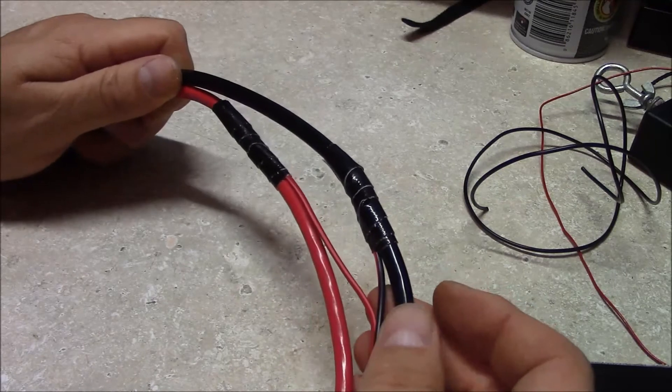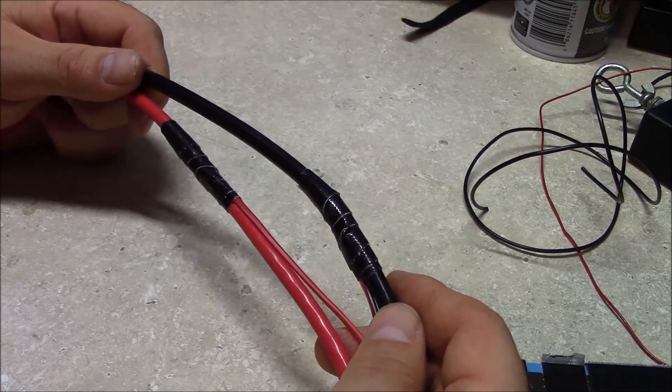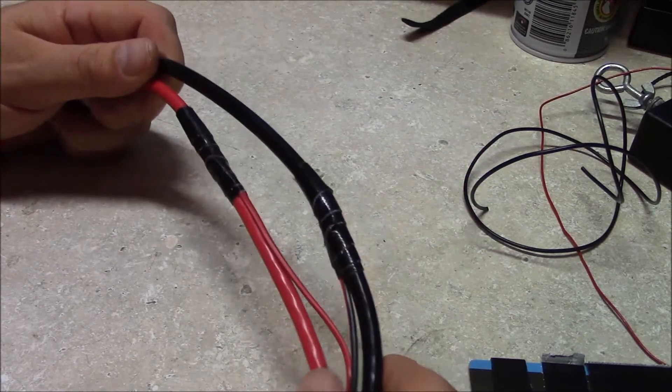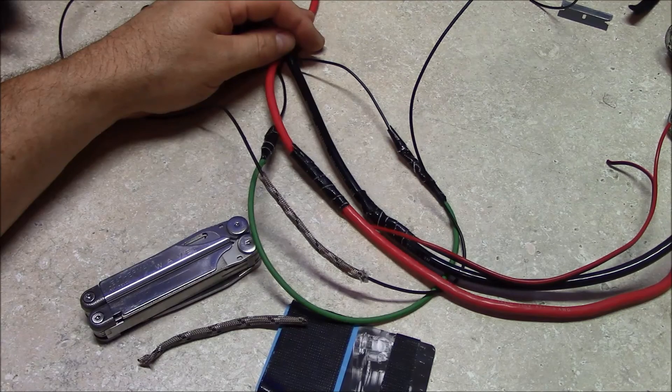When we did the ground, we just did the same thing. You want to make sure your splices are in different locations and make sure both are insulated. And if we had to tie in this small circuit into these existing DC wires, we would be good to go. I hope you never end up in a situation where you have to use a splice like this to complete a critical circuit, but if you do, you've got it in your toolbox. I hope this helps. This is Brett from Survival Comps — till next time, we'll see you soon.